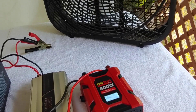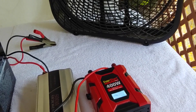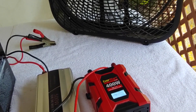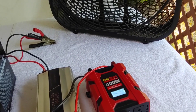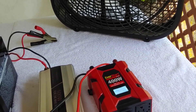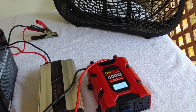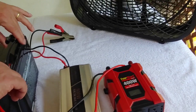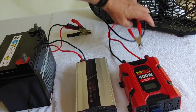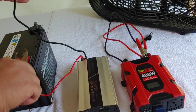I had a set of lights in my wife's studio that she said when the modified sine wave came on, it would flicker the lights. So there are differences between a modified and a pure sine wave. Now we're going to turn that one off and do the same thing with the pure sine wave, and hopefully you can hear the difference.